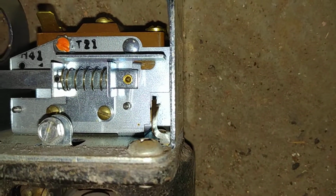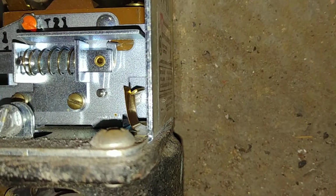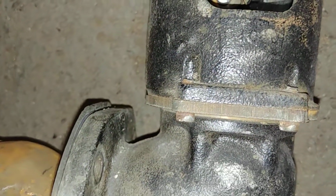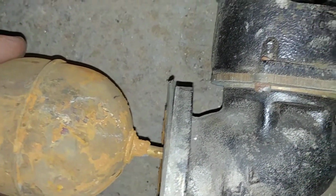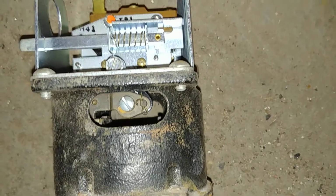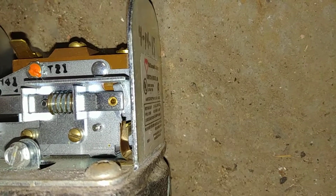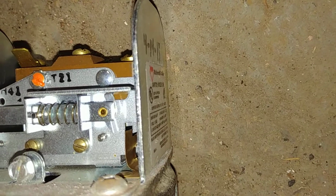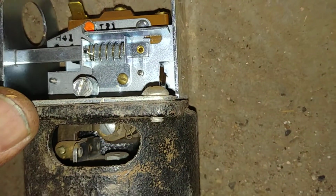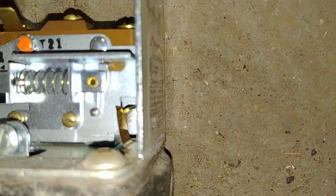And so when you blow down the control, the float drops, and that little piece of metal there just keeps it from resetting. So I can move the float back, and it won't reset. So if I hold it back, push the tab, see if we can reset, see that? Just like that. And that's the manual reset, just that.